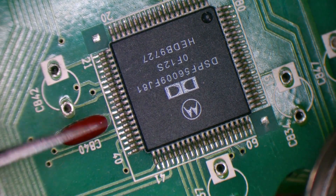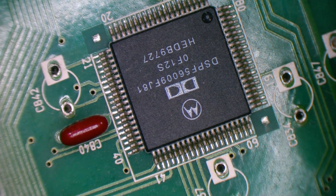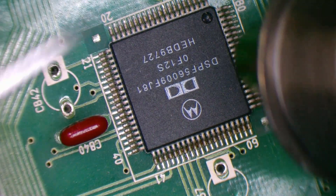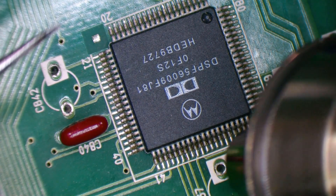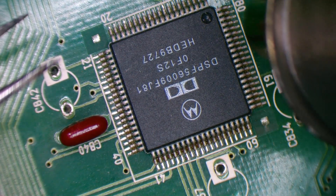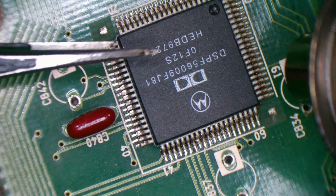Starting at 340 Celsius to see what happens, because we don't want to cook the board. Get a bit of heat into that. I think this little cap on the left is going to be fine because it's quite a hard package — just the other ones wrapped in plastic I'll be careful of, so I'll blow the heat away from the remaining caps.